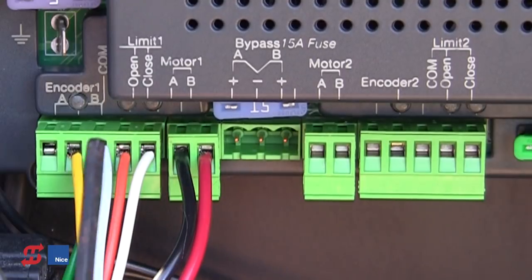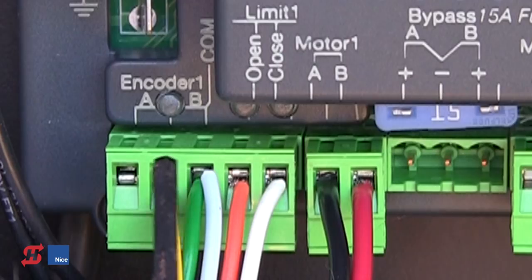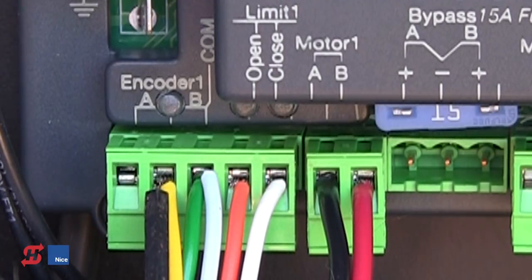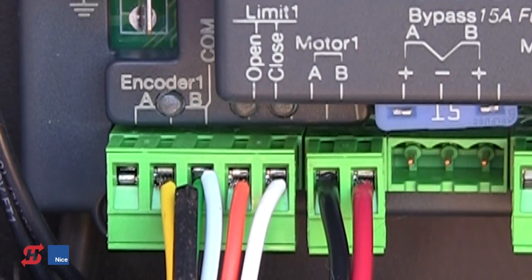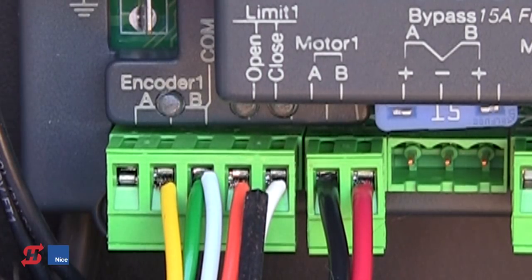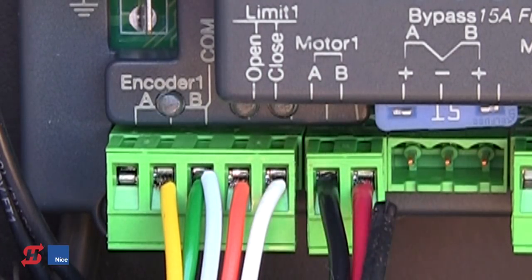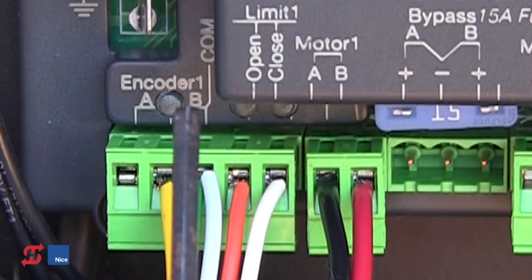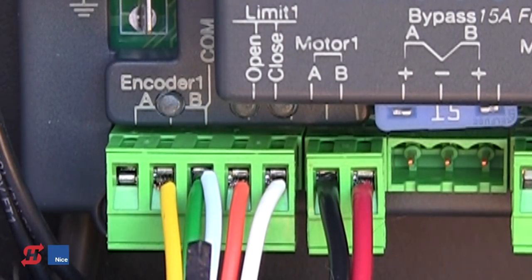For a Titan 12L actuator we connect here at the left on Motor 1. The first hole will be empty, the second hole will be our yellow wire, third hole blue and green, fourth hole orange, fifth hole white, then black on the left and the red motor wire on the right. This is for a pull-to-open installation. Refer to your instruction manual for exact wiring depending on whether it's a pull-open or push-open installation.